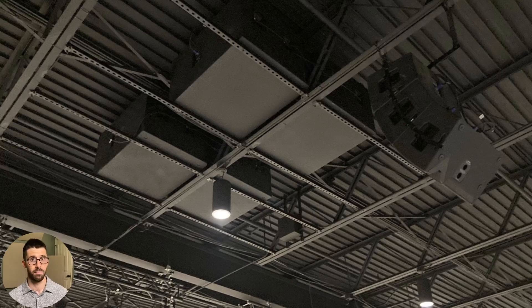I was recently hired by a church in Dallas to overhaul their sound system. Their building was getting renovated and they wanted to use some of their existing gear as well as purchase some additional gear to make sure the low end was amazing everywhere. So I came back with the design and showed them this. The subs are in the air — these are dual 18s and they're facing each other, not facing forward, one behind the other.